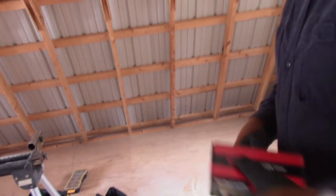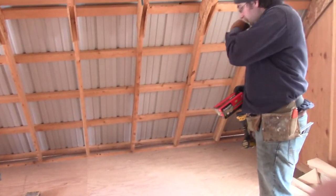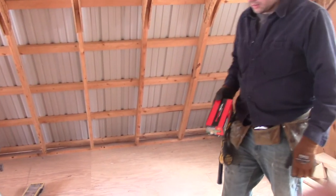Yeah. So what that's going to give us is a 2 foot bay, where our customer, when they do the installation, can run right up through. Yeah, they could just get craft. They get craft and they can run it right up through. It's 24 inch insulation. Wire chases. So we're not going to do a bottom plate though. Yeah, we're doing a bottom plate. Well, we don't have to. We're gonna.